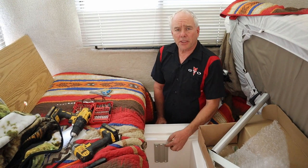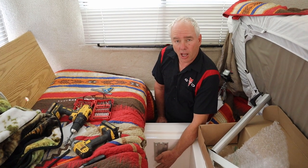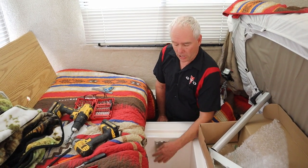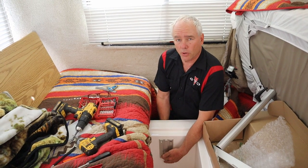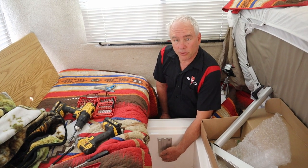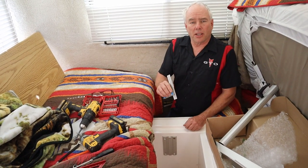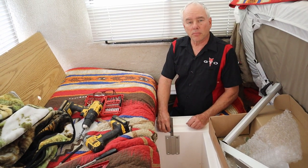Okay, so after I got the top tight enough to hold this in place, I went down to the opposite corner to drill it through after this is squared with the bench. The reason I went down to this corner is so I could rotate the wooden backing plate out of the way so I didn't make any extra holes in it. I used an adjustable square to square it up from the top of the seat base.